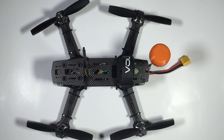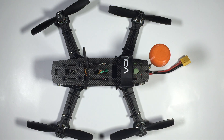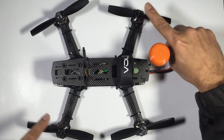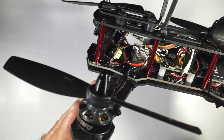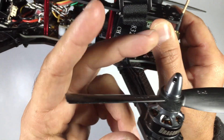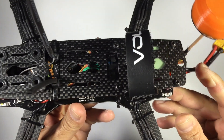We're going to need a bit more punch out of these motors. We're still running it on 3S — we probably should go down to 4S and we probably will later on. This is the type of strap we'll be using. It's worth noting that the motors came with both counter-clockwise and clockwise prop adapters, which ensures your props don't spin off or come loose. As you can see, we've got black spinners on one set and silver spinners on the other to identify which is which.